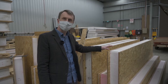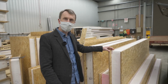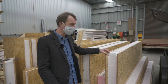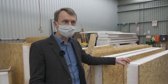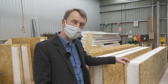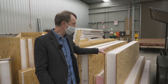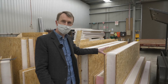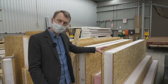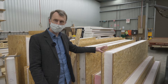To get something comparable to R 4.5, you'd have to do a double stud wall. That's something I've done in the past — it's quite a good system — except in our current climate we have a little bit of an issue with timber supply, so using twice as much stud framing for your walls is probably not a viable option at the moment. One of the advantages of these panels is they use substantially less timber framing than a conventional stud-framed building. Instead of having a vertical stud every 450mm, we just have vertical studs wherever there's a window or a door opening.